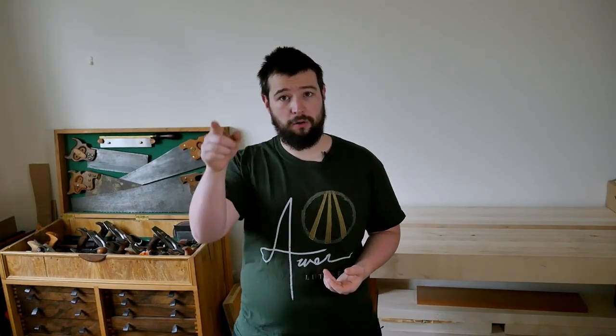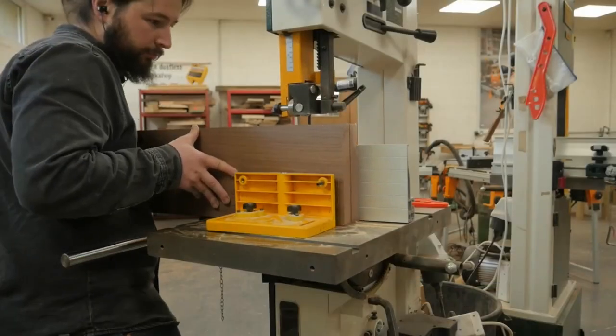While it may not be the most glamorous tool, or do the most things, simply being able to cut out shapes is so essential for guitar building. You can also fit different blades to these. A nice thin blade will be able to go around corners and shapes really easily and accurately, whereas a nice big thick blade you can use for resawing, to make tops. Being able to make and split your own tops is going to save you so much money. I definitely recommend getting a bandsaw — get a good bandsaw. Spend as much money as you can on it, because it will pay for itself in time.